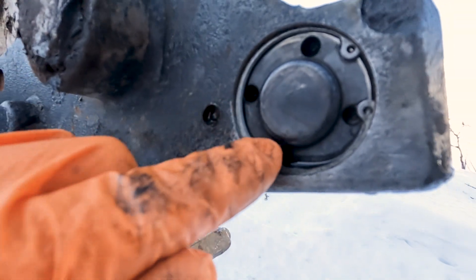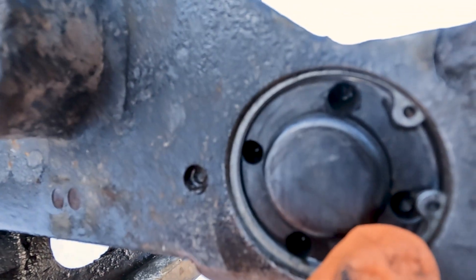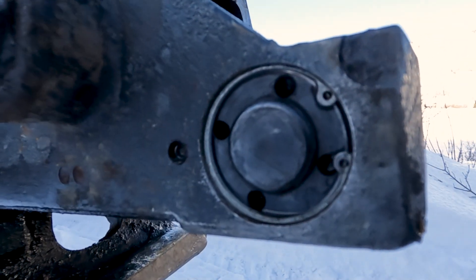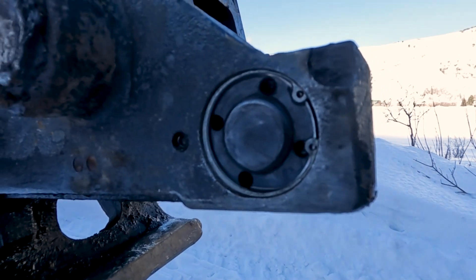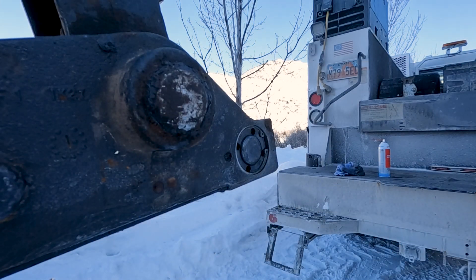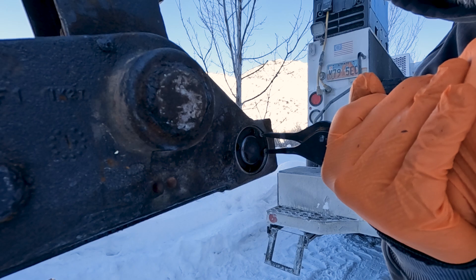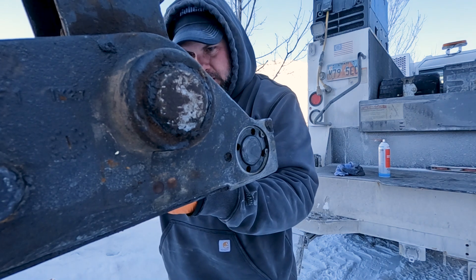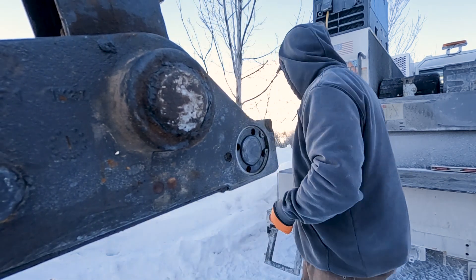On the other side, we can see how the snap ring is already bowing out - it's screwed out so hard against it, it's trying to push it out of its groove. We've got a tool that goes into these holes to screw that back in, but the snap ring is right on one of those holes, making it difficult to even get the tool in. Sometimes these snap rings are a real fight to get out. We'll try the obvious method first - snap ring pliers - but it won't even budge on either side. Both snap rings are just wedged in there solid.